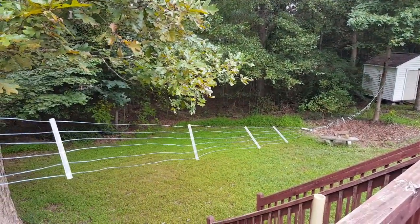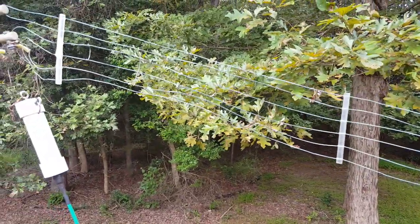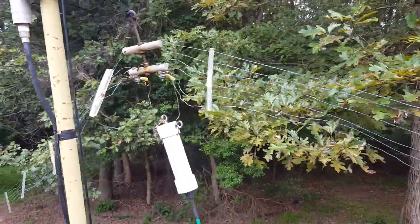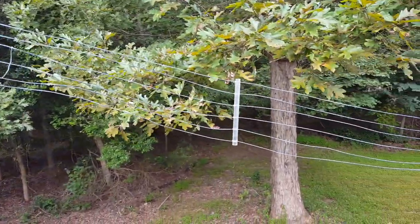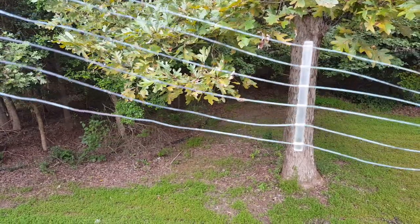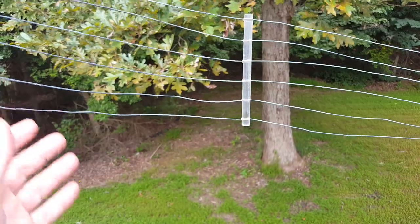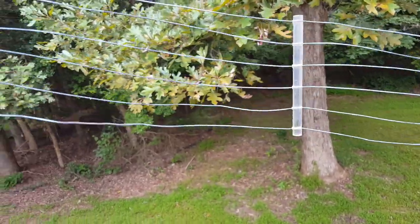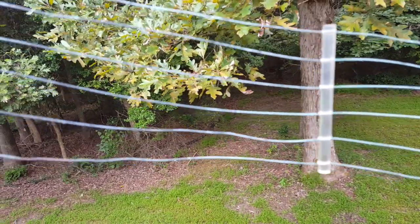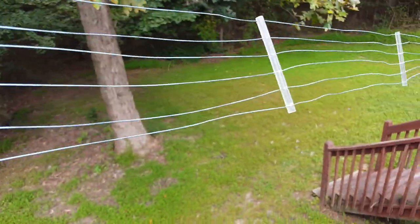There you have it — a Morgain 5-band dipole. I highly recommend you look up the schematic for this rather than making one yourself — it's really not a big deal. Use solid copper, not stranded copper, when making antennas. Hard-drawn solid copper wire would be good. Try to get the tinned stuff — tinned antenna wire if they still sell it.